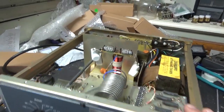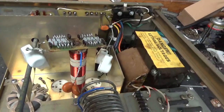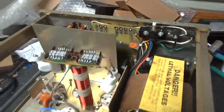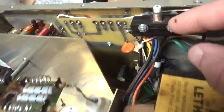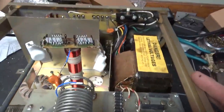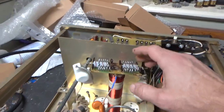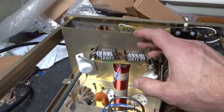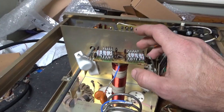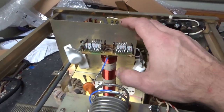I'm going to go over what I see real quick, and then I'm going to get to work. It's really early here and I have a lot to get done today. So this is an older one — it doesn't have the diodes on the rear boards. I'll add them and do everything else I normally do. It needs a bias mod. Assuming the repair shop put this choke in and this parasitic board in — it probably had the old style parasitic setup and the old choke.